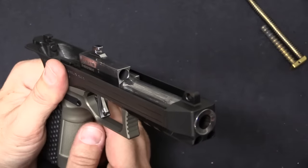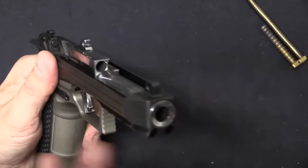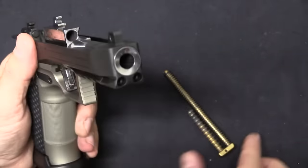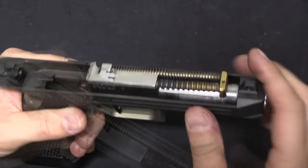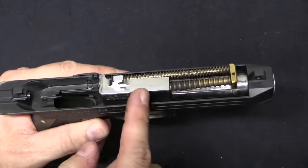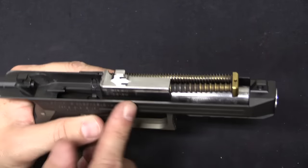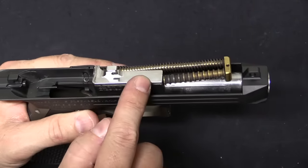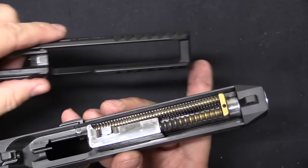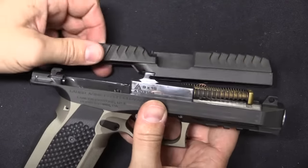The Alien is mechanically closest to something like an H&K P7. There are a number of other gas-delayed guns out there; the P7 is the best and most common of them. Where the P7 had the gas port on the bottom of the barrel, the Alien has it on the top. When the gun is at rest the gas assembly sits up on top, and when the slide goes back the gas piston reciprocates into the piston chamber. There is a port in the chamber right in front of the case mouth. As soon as the pistol fires, gas bleeds from the barrel up into this piston chamber, putting pressure on the gas piston which pushes it forward. That force is transmitted into the slide through a lug at the front, and it holds the slide closed as long as there is pressure in this chamber.